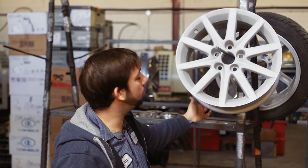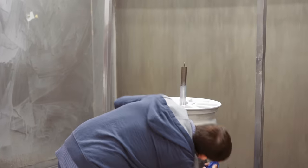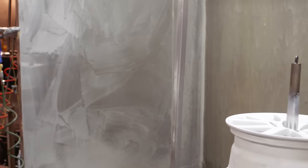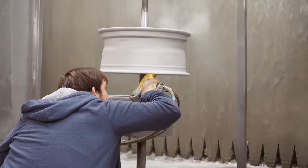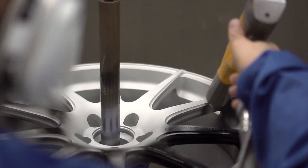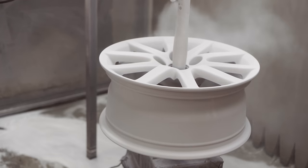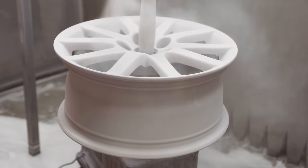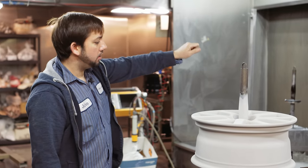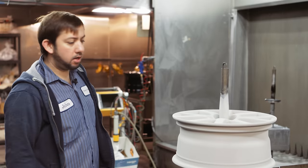So now we just bring it into the booth and put the first coat on. This is the primer coat, which is an epoxy-based primer. I always like to start from the bottom. This is not hot coat like the other video we've done before — we're going to spray all three coats cold. I'm going to go a little bit heavier with the primer here, just to fill up all the pits from all the corrosion. It's all sprayed inside out, still in powder form. I'm going to preheat the oven, put it in, bake it, and it comes out creating pretty much a shell on it. Let it cool down and then spray the following coats on it.